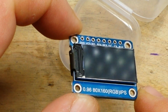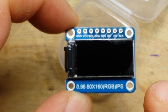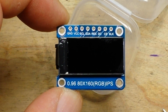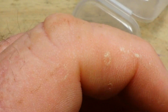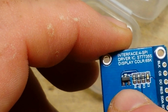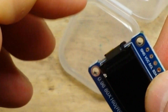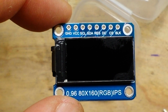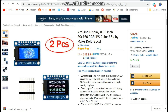There's one thing you have to be aware of: if you try to run this at 3.3 volts as the documentation suggests, it's not going to work. I believe there's a little voltage regulator on here, but it only works correctly at 5 volts — so it's good straight through for any of your Arduino projects.